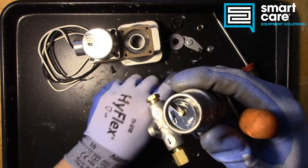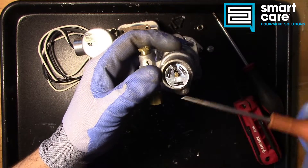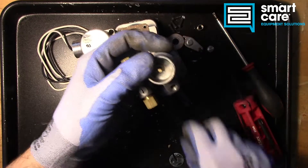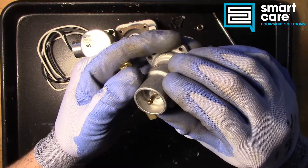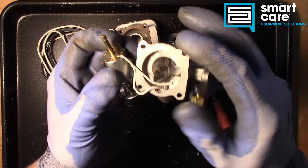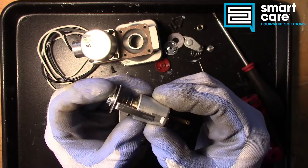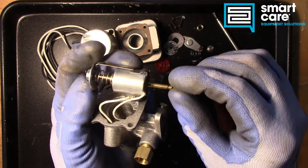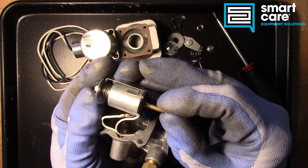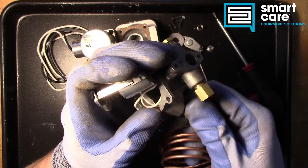So we've popped off the red plastic cap, we've got a spring retainer inside. Once we work this spring retainer off, we should be able to get the rest of this assembly out. There goes the spring and the retainer. So now we can pop this out — you can see it's soldered down into the casing here, but this is the electromagnet, the coil that actually interacts with our plunger. So when we push the button down, it compresses this electromagnet over the plunger, and then when we let go it pulls the entire assembly back up. Now that we've got this apart, we can hook our thermocouple back up and I can show you exactly what's happening inside this valve.